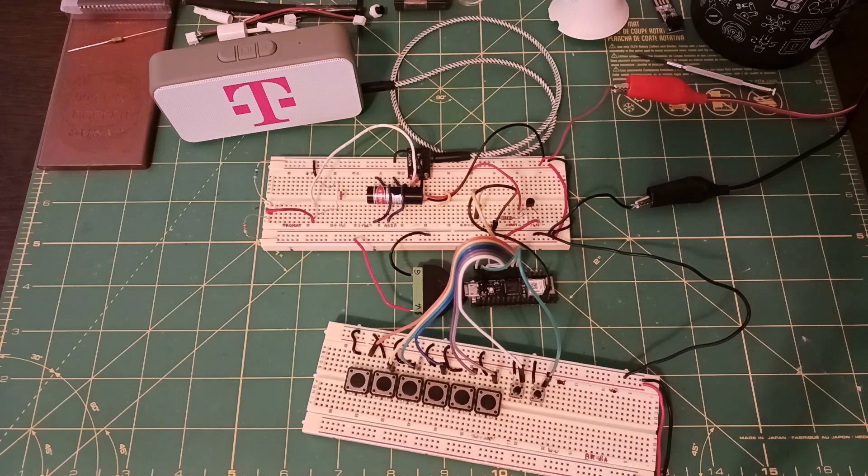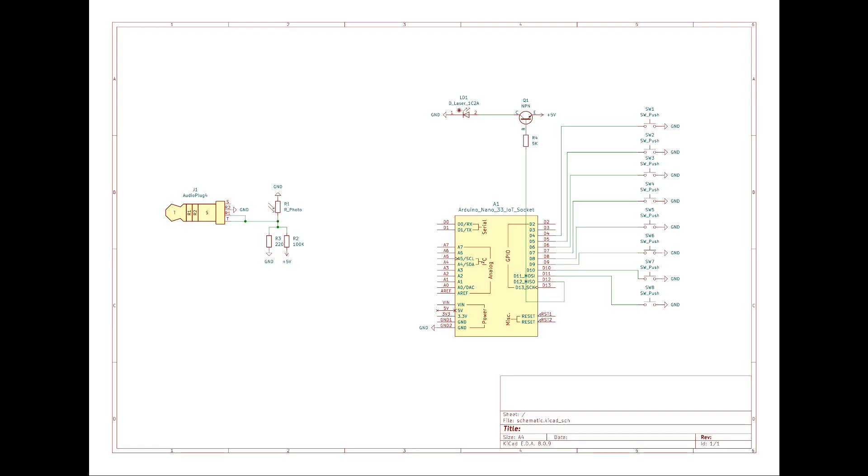Now as for those patterns, each musical note has a particular frequency. For example, middle C has a frequency of about 261 Hz and D4 is 293 Hz. I tailored the on-off patterns to match these frequencies. Here's a diagram of the circuit — feel free to grab a screenshot or check the video description for a higher resolution version of it.